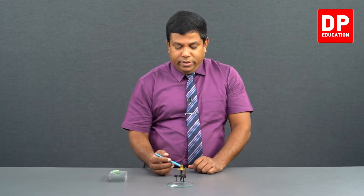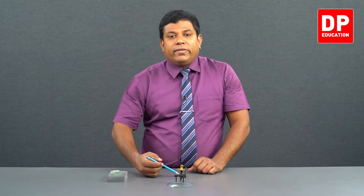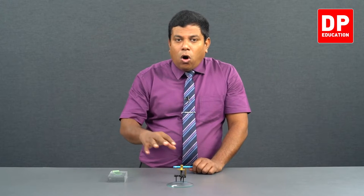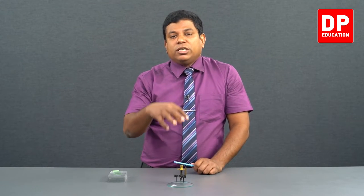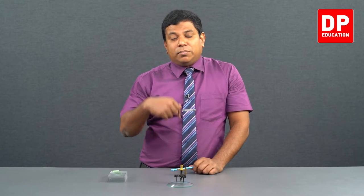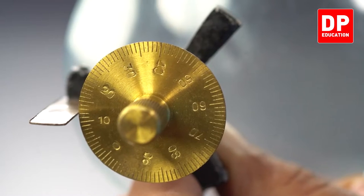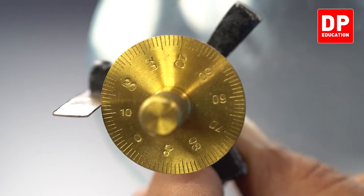Now you can see the screw tip and its image touch each other. They are in contact. That's the first moment I got them in contact, which means now all four tips, the three legs and the screw tip, all touch the curved surface. If I can get the reading now and subtract it from the first reading where I got all four on the same flat surface, then I can get the h, right? So let's get the reading now.